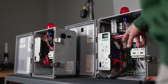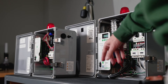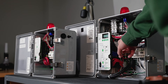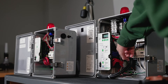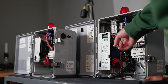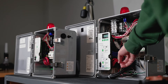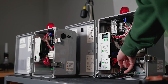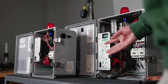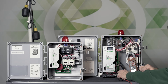In the menu, by default it says four floats when you get to that section. The reason it says four floats is that if you have four floats but these two are jumpered, it's just going to act like a three float system anyway. But having that four float default means if you want to use a four float system, you hook up all four and pull the jumper out — you wouldn't have to change anything in the menu.